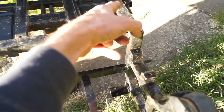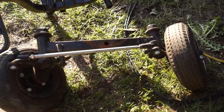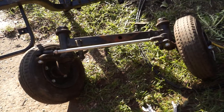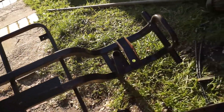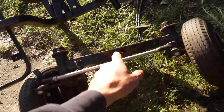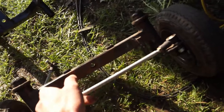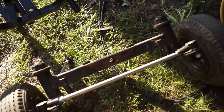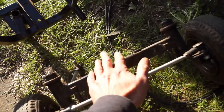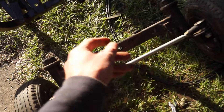That's where the axle will fit and the wheels will fit in these gaps. The first problem I'm going to have is the steering. Originally I was going to use the center part and get some bike forks to make it single wheel, but I think I'm going with the second option - using the double original steering mechanism but shortening it to the same length as the back axle, so it's four wheels. The plan is to cut and weld those two pieces together, reattach to the original frame, then cut and shorten this section too.